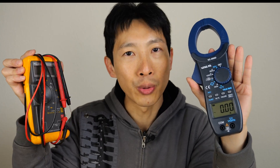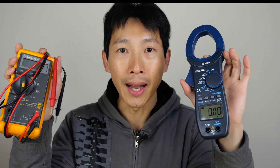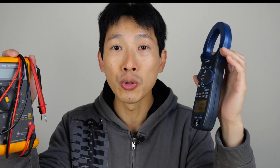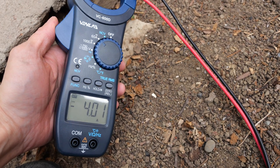Why would you use such a thing in comparison to a traditional multimeter like this one? These guys are really low cost in comparison to the industry standard of Fluke multimeters. When I was working, I always used Flukes because you really want high accuracy, and usually at companies every single year they do a calibration to make sure the absolute reading on these things is what you're actually seeing on the meter, because this is going to affect how you design things. These meters, the accuracy is not as good. Most of the time when you're at home, you don't need very high accuracy — you're usually fixing a one-off item and if it's off by 1%, it really doesn't matter. For example, let's say I'm reading the amperage out of some solar panels and it gives me a good idea of how much electricity I'm generating — so what if it's off by 10%?